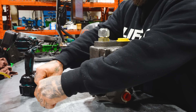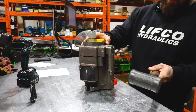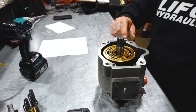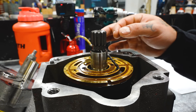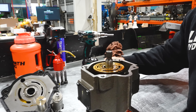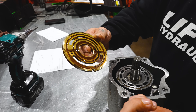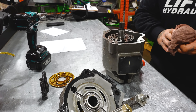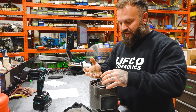This is a PVP 41 with a standard pressure comp with a 3,600 psi max set. Now we're into some stuff already. You come around here — that's not supposed to be there. It's either a barrel pin or one of the needle bearings in this bearing here, so that's initially not good. We can see some varnishing on there and also some metal shavings. Varnishing is usually like a chemical reaction in the oil. Something's not going to be good under there.